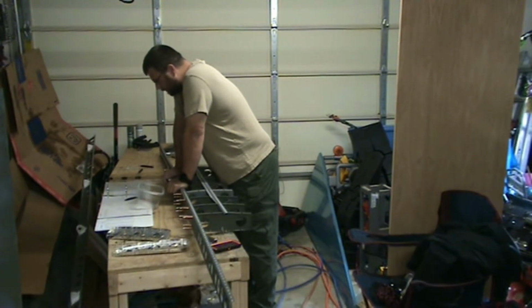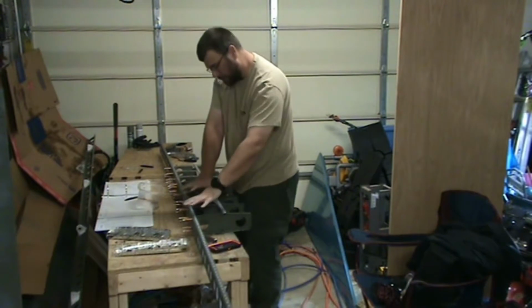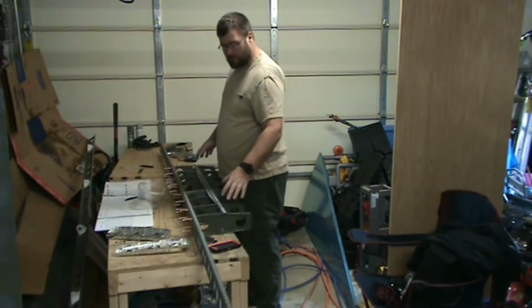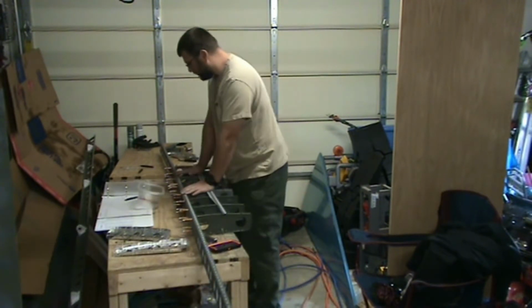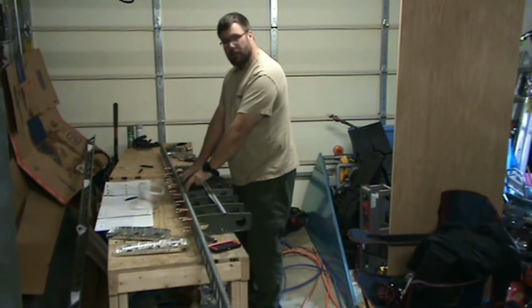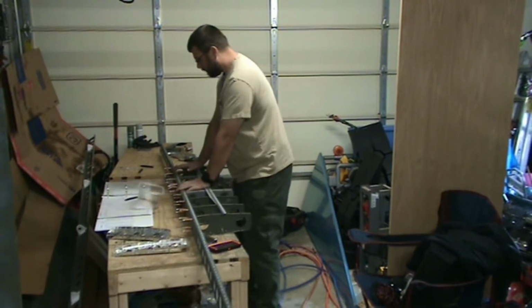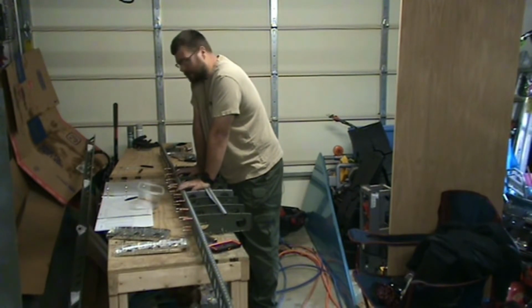Part of step three is riveting these ribs in place. So I probably can rivet these ones already Clecoed in place while I wait for the primer to dry on those two ribs. It shouldn't have any impact. Just remember, as it says in the note, don't do the two inboard ones. They have nose ribs that attach through those holes as well, and if you rivet them now, you'll be drilling all the rivets out so you can attach the ribs later.